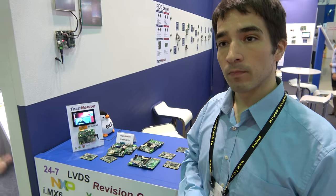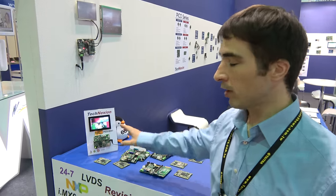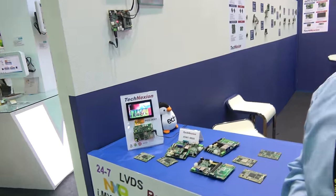Is this part of your software solution? We are providing all the BSP and all the source code for Linux, Yocto, and Android. And of course we are providing some software for the Cortex-M4. The interaction between the Cortex-M4 and the Cortex-A7 is up to the user, but there are already basic samples inside the source code showing how to do it.